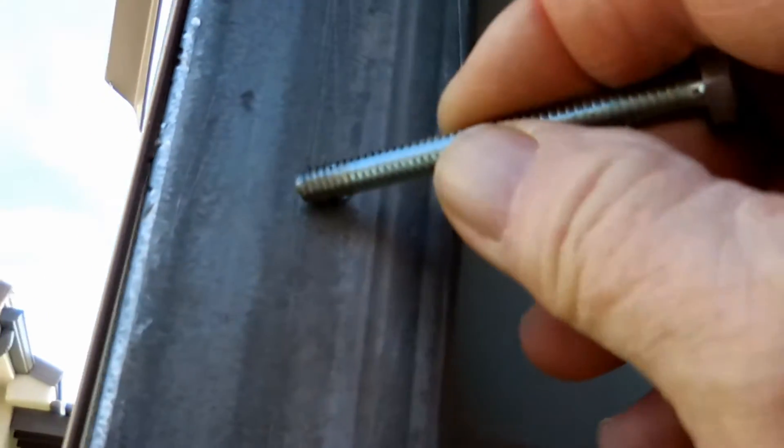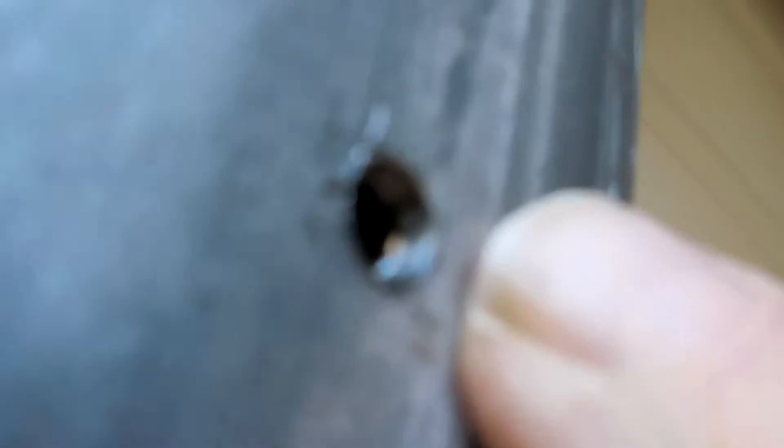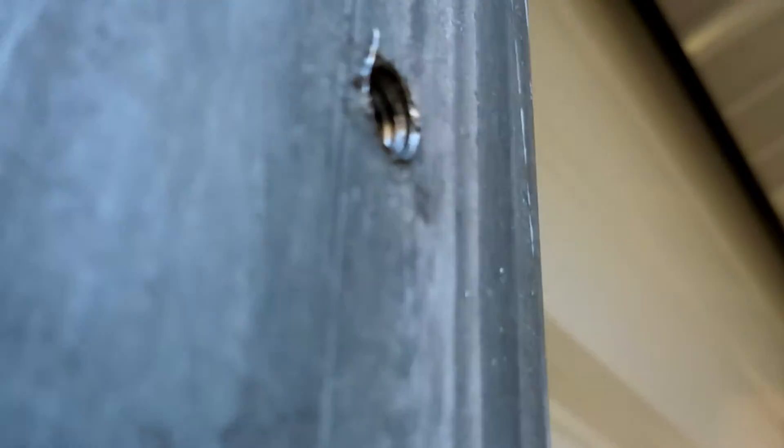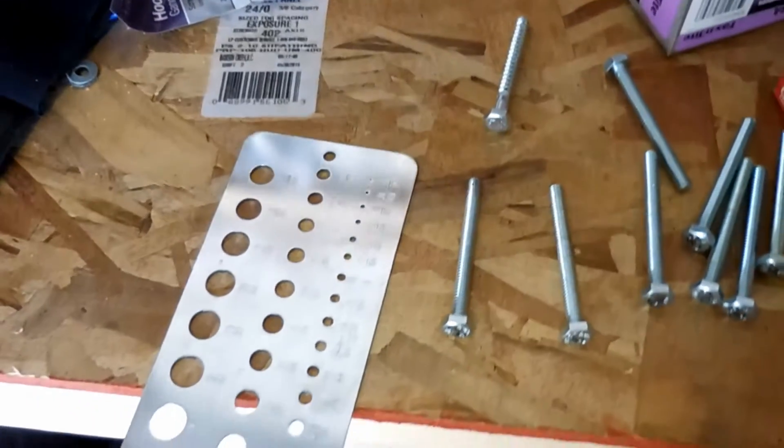I have every size up to a half inch. There happened to be a hole in there already — not one that I put in. So I went ahead and tapped it in there. Because it gets at least three threads of grip through 14 gauge thickness — you can see there's a grip of three threads — and that will just go in there like that. That's what you want: a real good solid mount. That lag bolt was not going to cut it. It's a little detail that may be of interest to some; others may already be aware of it. I've been asked for a little more detail on my projects, and of course that comes with a longer video.